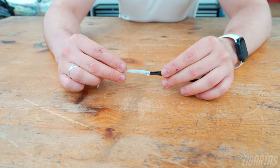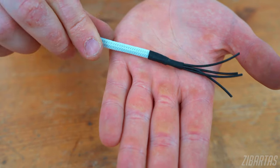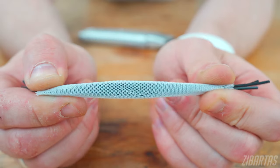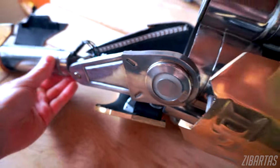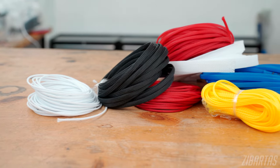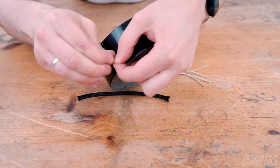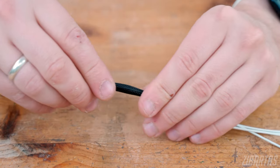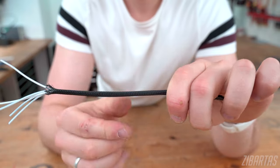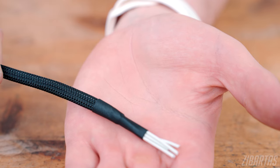Wire sleeving is a great way of combining a lot of individual wires into a single solid cable, and it's almost unfair how good it looks. In addition to making your cable run look more sleek and uniform, it will also provide mechanical protection. I really wish I knew about this before I built my Doomfist gauntlet — additional wire protection in the elbow joint would have saved me hours of repair time. This braided sleeving comes in different lengths, widths, and colors; some is round and some is flat. One thing to know is that they're braided like a Chinese finger trap, so if you over-tighten them, they make the cable quite stiff. To terminate the ends, you can use a zip tie, shrink tube, or just melt it shut.